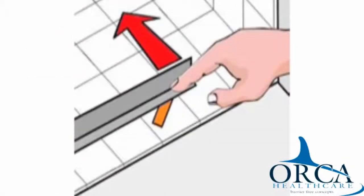Before you begin, please note that adhesion may be poor on surfaces such as tile that have been treated with silicone-based sealers. Test by peeling back about 1 inch of the liner and press the adhesive area to the surface it will be installed on and leave overnight. The next morning, test the adhesion by pushing it sideways. If the adhesion is satisfactory, pull straight up and proceed with the installation. If it is not satisfactory, surface preparation or mechanical attachment may be necessary.